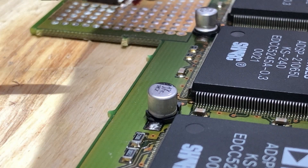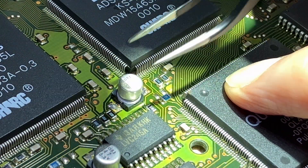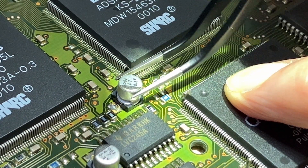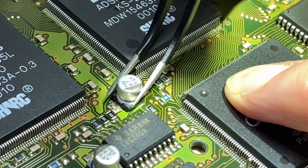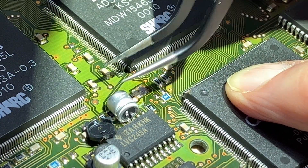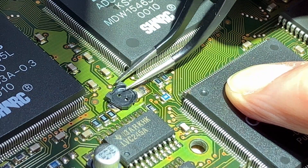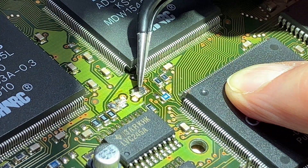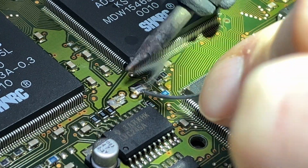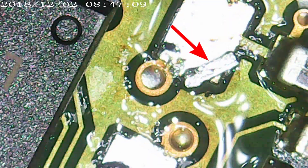For the other caps on the board, I found the best way to remove the old ones — although it feels horrible the first time — is to just twist them off using tweezers or needle nose pliers. I recapped about 30 or 40 capacitors using this method and it worked perfectly every time. I was worried it would bring pads off the board, but it didn't. One thing you have to be careful of: twisting does leave behind the metal legs from the capacitor, and if you don't collect those they could end up loose on the board and potentially cause a short. You can see a leg there at about 45 degrees — that needs to be removed.